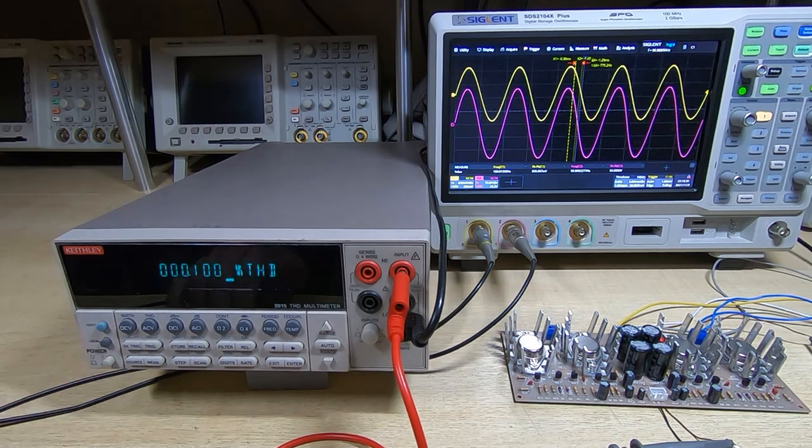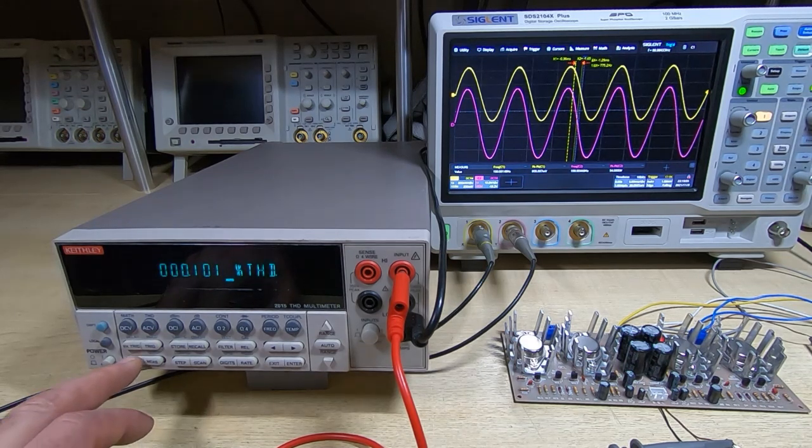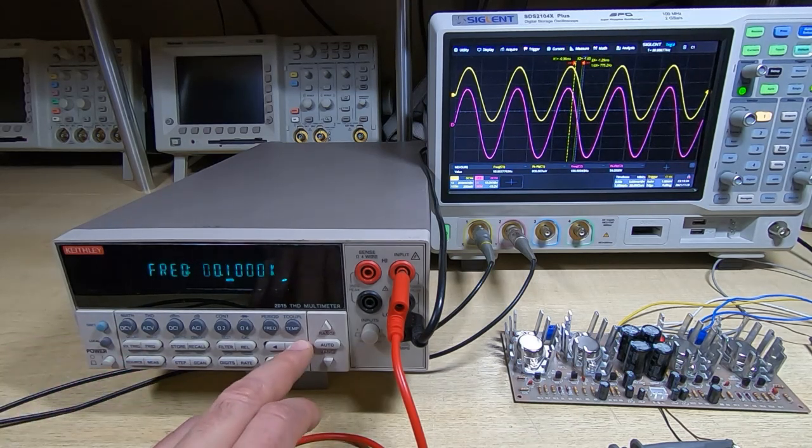And although 35 watts is still way short of the quoted 100 watts, as I said, remember that 100 watts is spread across the entire spectrum, and we're just looking at one frequency here. So finally we'll go down to 50 Hz, which is as low as most bass speakers, other than the very expensive ones, will go, and we'll see how much power that will give us. At the moment we're drawing about 600 milliamps from each of the two power supply rails. Okay, so now we'll set the frequency to 50 Hz.